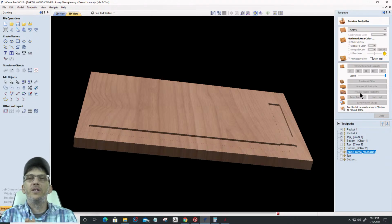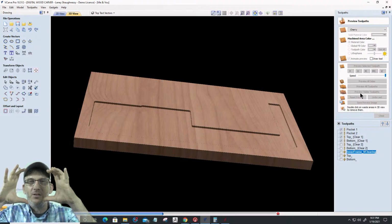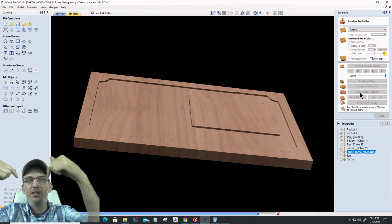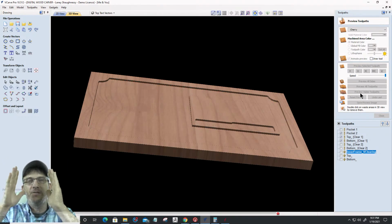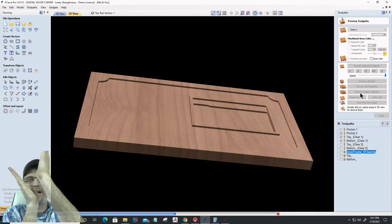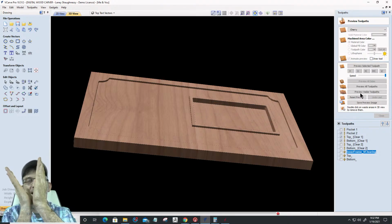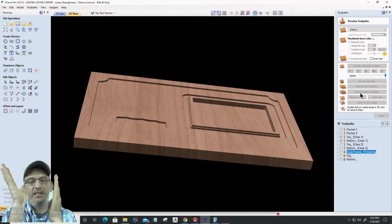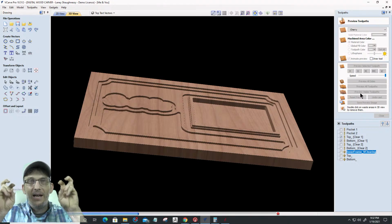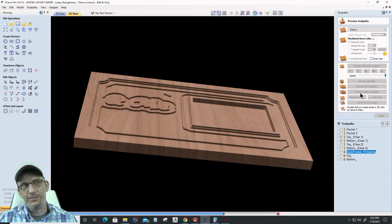I need to create the initial clearing on the original vector of the outside of that square frame. From 0 to 1/8 of an inch, I'm doing a profile cut, offsetting it inward 1/8 of an inch to create that little chamfer. That brings that material back so my bit can come down and do that next step without the shank colliding. Okay, it can do that next step outward. And then my bottom layer needs to go even further outward, so I had to offset that bottom layer rectangle outward by my 0.0722.